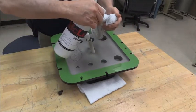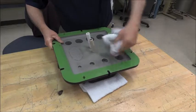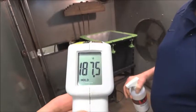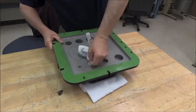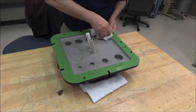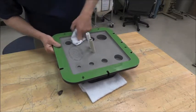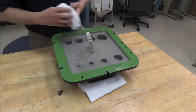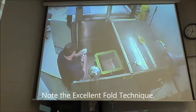For detailed areas, we just wet a little bit of the tip of the rag and swirl it around. Alternatively, you can spray a little bit into the hole, as long as it's not too hot and the mold release isn't evaporating too fast, then work it around to ensure proper application. For this tooling, we have the temperature set to about 180°F. We typically like to see 150°F or higher for initial application, as it facilitates evaporation of water and helps the material lay out nicer — picture water on a warm surface, like a hot car, it tends to sheet better than on a cool surface.